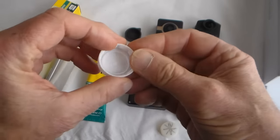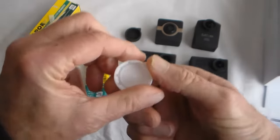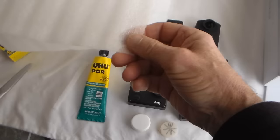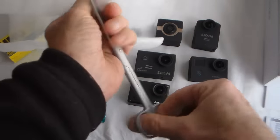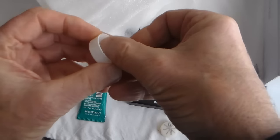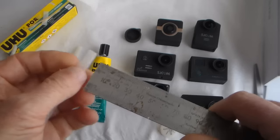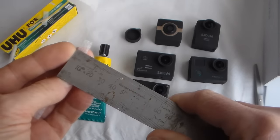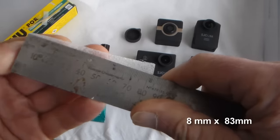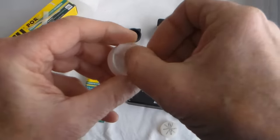Coca-Cola type bottle lids are just about the right size but too loose, so I cut some foam — the kind of stuff you get around packaging when you buy from Amazon and so on. Just cut a strip like so. The width wants to be such that it will fit in here and be slightly proud of the top, just sticking out a little bit. A width of about 8mm is good, and a length of 83mm, and that will just fit in here like so.